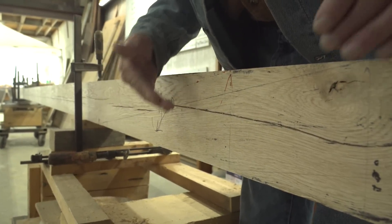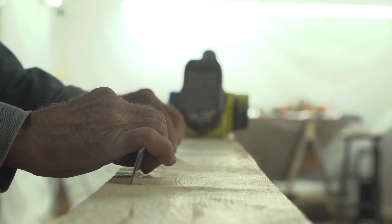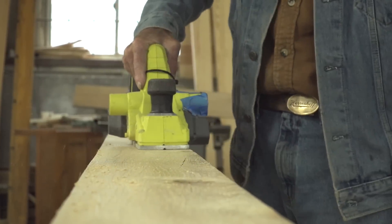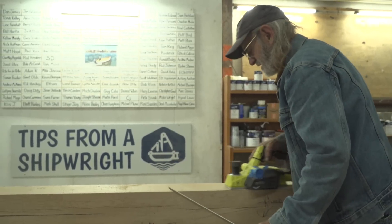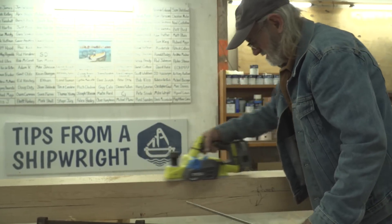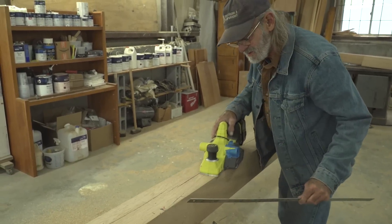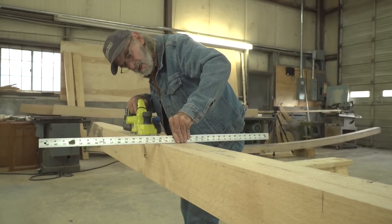It's the same thing we did back aft, except the scarf is a little bit different. Before I make this cut or even mark it out, I'm going to make sure that the timber is nice and square — especially take the lumps out — because otherwise the saw will rock over the lumps and not work really good. The lumps are really near where the knots used to be, because as it seasons, it doesn't shrink as much and it leaves the knots proud. So I'm going to trim them down with my little electric plane. I've sighted those timbers to make sure they're not twisted — all those kinds of things in order to make this come off properly.